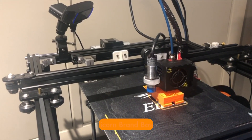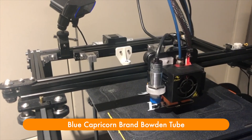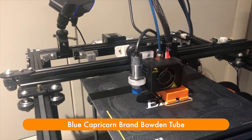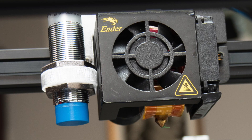I did make some modifications to the Ender 5. First, I replaced the couplers and the Bowden tube with a Capricorn tube, which is much more precise, allows printing at higher temperatures, and uses much better couplers. I also have an easy ABL bed leveling kit. The more level the bed, the more likely your print will stick well to it, which reduces movement while printing fast.